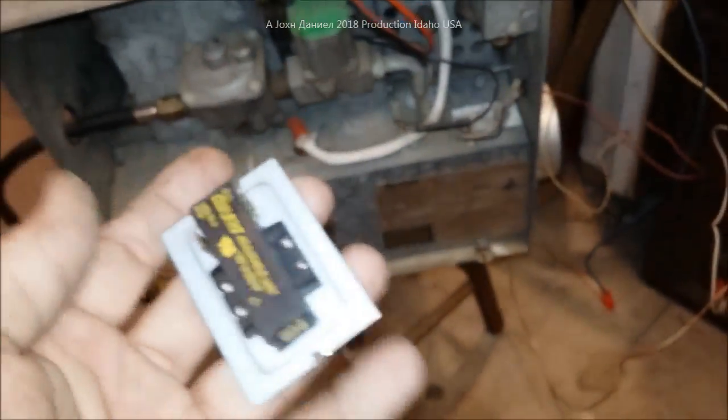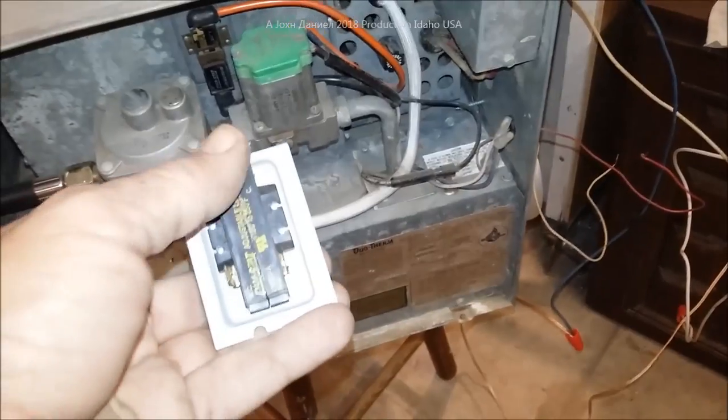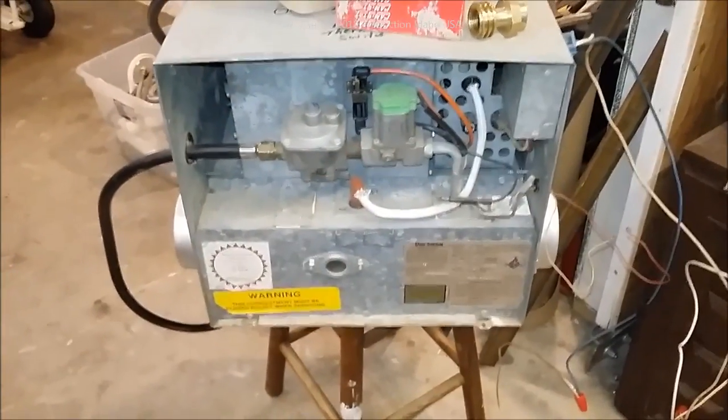So what we've got is a heater that will not shut off. You can find these still on places like eBay — old stock, still original — but they don't usually look like that model that's in most heaters. This is a Duratherm. This one here is a cam stat adjustable limit. It's a little different because it has a normally closed position, which is what that one is set for, and it opens at a certain temperature level. It also has another switch that is normally open, which closes when it reaches that temperature. So if you have a powered-down solenoid it would power down; if you have a power disconnect it would disconnect — in this case it disconnects the flow of gas.